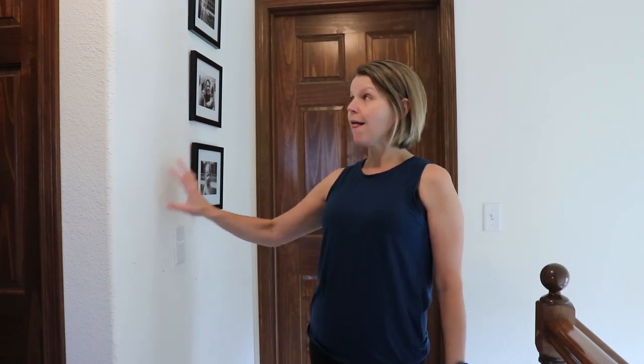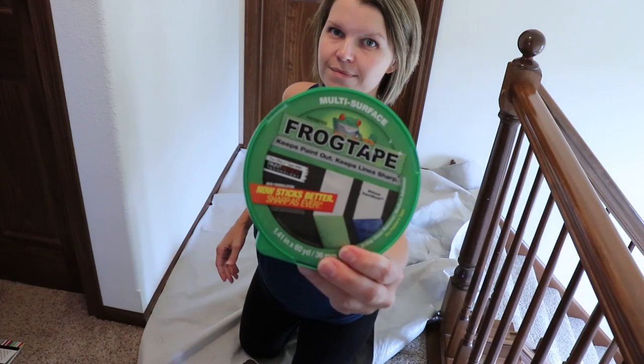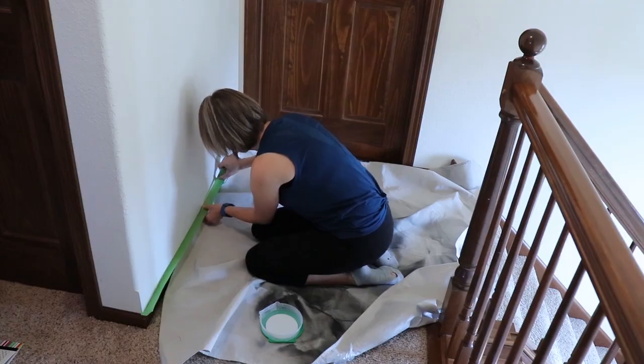The first thing I am going to do is take everything off this wall and get it prepped. I am going to paint this using an ultra white paint from Behr — it's a Behr Marquee paint in a satin finish. When these walls were originally painted they were done with a flat paint, and that's left a lot of damage on the walls because all the fingerprints and touching and bumping just stays on the wall and it is not a good look. So we're going to start by painting this white and letting it dry, and then we'll get into the stencil.